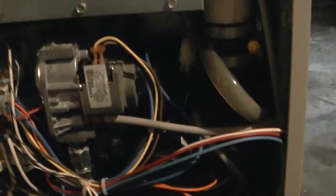Don't forget to check your power off to the furnace before you start taking it apart. My power switch just happens to be up there - I've flipped it off. And don't forget to shut your gas off also, just for good safe measures.